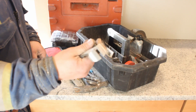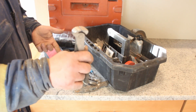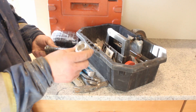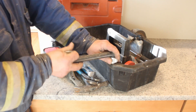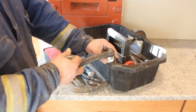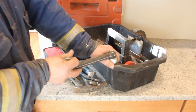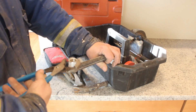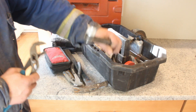These are good for pulling staples and nails — sometimes you put a box in the wrong place, sometimes the box breaks, sometimes you've got to pull staples. They just give you a little more leverage and make it easier. Now this is a Klein tool made to tighten and loosen lock nuts — half inch and three-quarter. You put it on the lock nut in a box and use this, or use pliers on it, or your hand if it's not too tight. It has a hole so wires can come through, and you can take a pair of channel locks and use it to give yourself leverage to tighten. Sometimes it's hard to get into a little work box — this makes it easier.